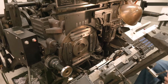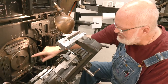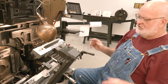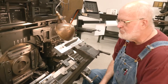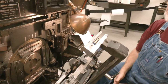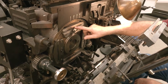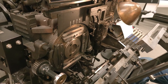What alternate casting was used for was if you only did two sizes — you put the same size in both of these and the same size in both of those. You could run faster because you're using two molds and it cools off quicker. They also put blowers on them to help with that. The third way of doing it is called progressive casting. You have one three-quarter turn mold, no quarter turn — so it would cast on this mold up here, make three-quarters of a turn and kick it out, and then the mold that was at the top it would cast on that one, three-quarters of a turn and kick it out. And it would walk its way around the molds, so you're using all four molds.